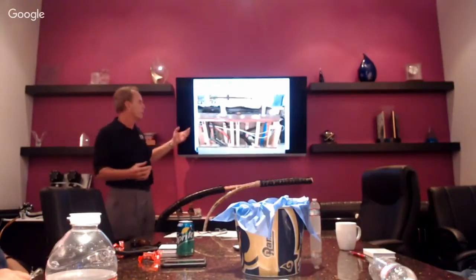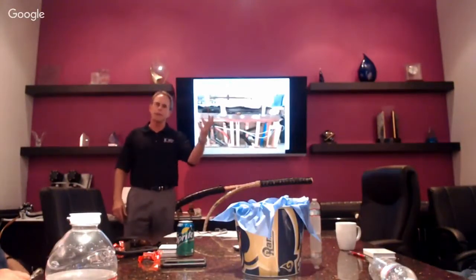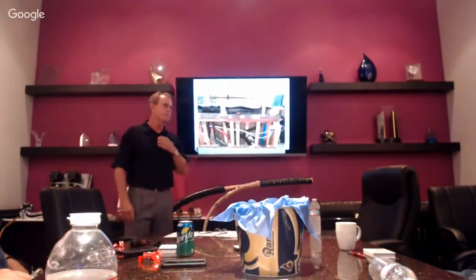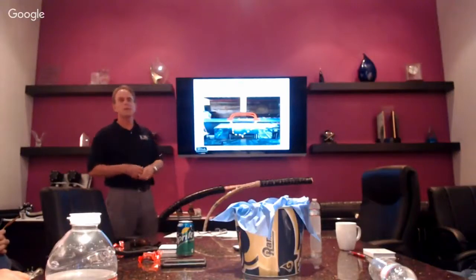So if you're going over a particular area, maybe on the back bar, and you got a refrigerator here, in the cabinet here, maybe we could get all the leads left and come into the cabinet, stub up over there. Given it's the front bar, a lot more trades are working in there. Whether this is mod bar or not, that tower is not going in the die wall. It's going to be surface mount to the bartender side, and there's no chimneys on the equipment.